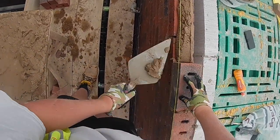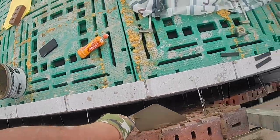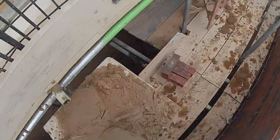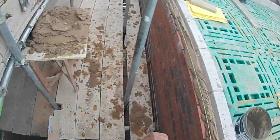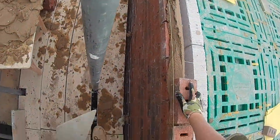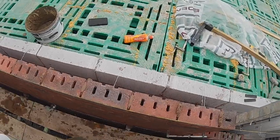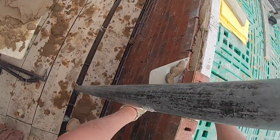When it comes to keeping your trays clear on the cavities: first six courses, I didn't put anything in the cavity — just built it without anything in. Then I just put a lath behind every six courses. After the first six, the tray goes on, then a lath every six from there. When I get to the table lift the lath can probably stay in because it'll be narrow enough to stretch the full length and just slide out. That's one reason I wanted to take it a couple more courses higher on the adjacent side — it makes everything easier, less gear to carry up the scaffold, and you could save an extra 80 to 120 bricks.